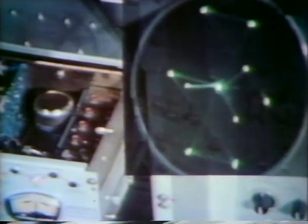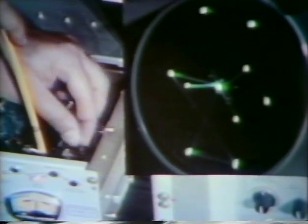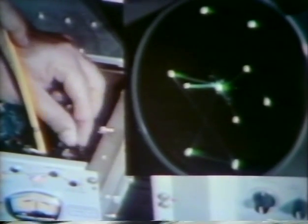Continuing playback, select reference position on the burst selector switch on Colortech. Observe the position of burst on the vectorscope, and correct if necessary by adjusting L2, the tunable inductance adjacent to the burst selector switch. An A-B comparison of tape and reference burst should now show no difference in phase.